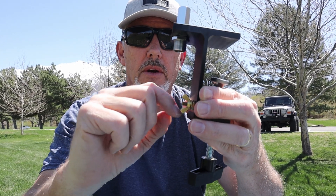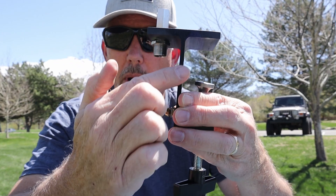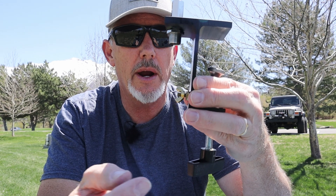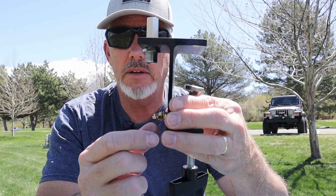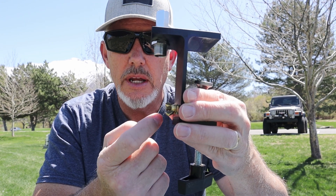They have a ground screw on here, mounted to the bracket plate. When you screw your coax in, this part of the antenna bracket is your ground, and here's where you hook up your radials. You can strip back some wire, or if you've got a connector on the end, you screw the wing nut all the way off, put your connector on, and screw it back down.